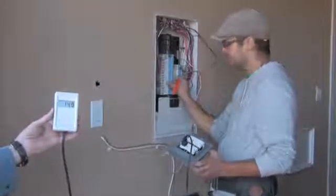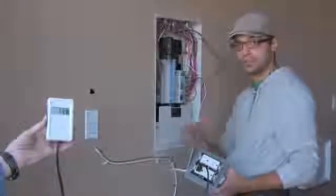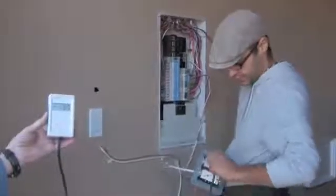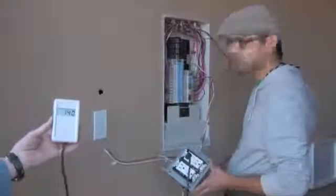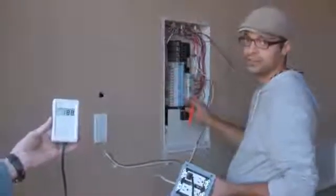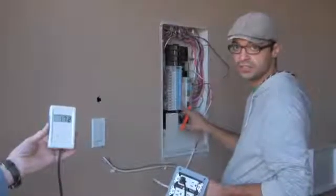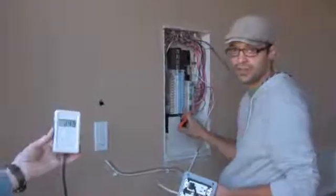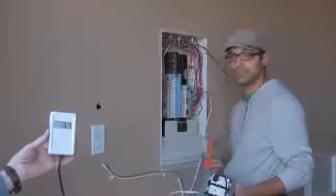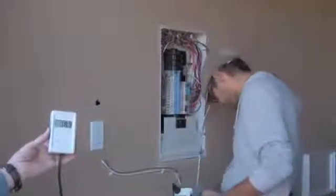150. So what we'll do is go through each breaker in that fashion and determine which ones cause the highest dirty power, and then switch over to the other phase and repeat the same process. Okay. And then once we've figured out which breakers are contributing the most dirty power, we can go through the house and look at those circuits individually and figure out what it could be on that circuit that's causing the extreme amounts of dirty power. That's pretty much the only way to go through the house thoroughly and take care of it. Excellent.